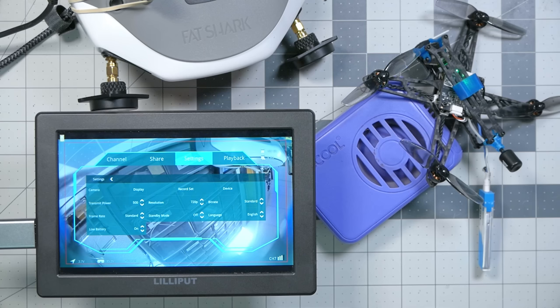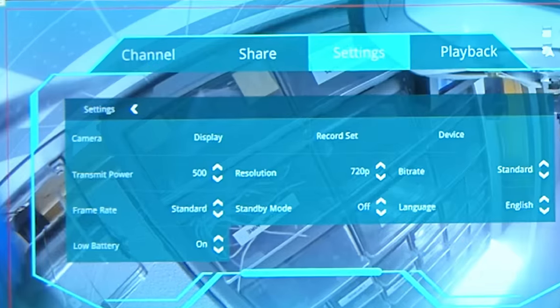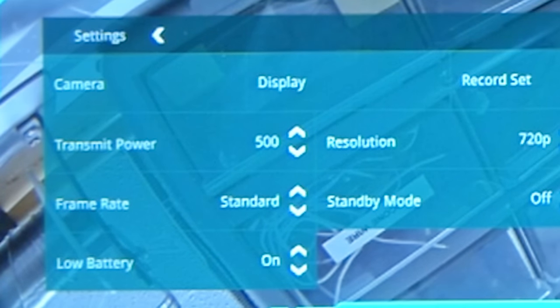The next thing I wondered was how much this high-powered video transmitter would affect flight time. I plugged in a fully charged 450mAh battery, set the VTX to max output power, and waited. After 10 minutes the battery was down to about 3.7 volts — totally fine. It draws a lot at max power, but nothing that's really noticeable when flight time on these little quads is typically two to three minutes. At max output power it's set to 500mW in this firmware; there's no 350mW setting yet. When you set it to 500mW or above, it's actually at 350mW. They'll fix that in a future firmware.